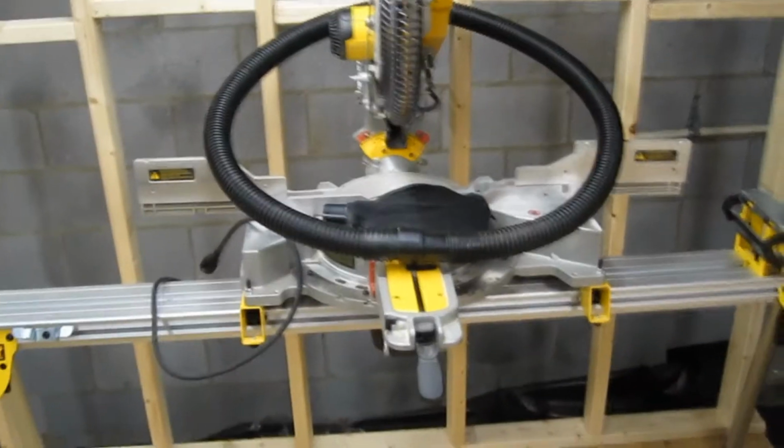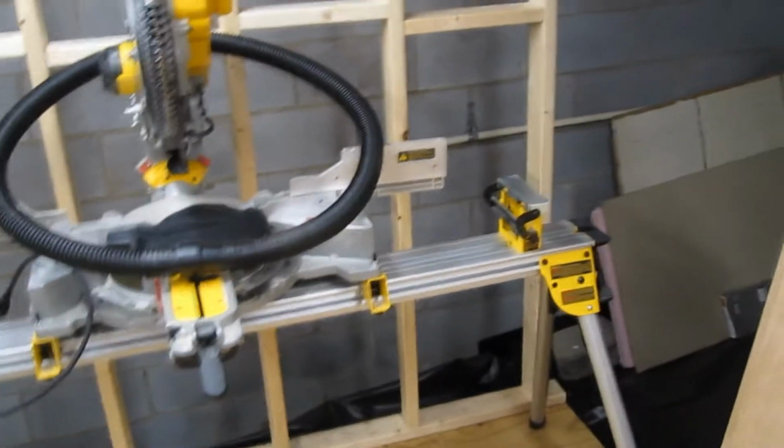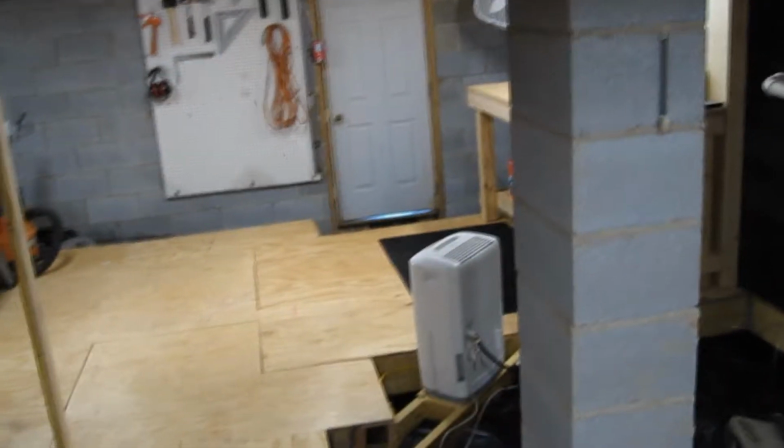All this will make the cart 6 4x4 parts. And I think I've changed my mind. Rather than doing a long miter station through the whole wall here, I'm going to make just a rolling one, because I don't know that we'll be in this house forever, and if I build something, I certainly want to take it with me. I also have a little constraint. I have to get through that door, and that door is just perfectly 31 inches. So everything that I make in here, like the workbench, I made it so it would fit through. The outfeed table will fit through just barely at 31 inches. So I want to make sure everything goes through. So I think that's what I'm going to do with the miter saw station, maybe after the outfeed cart, I don't know.